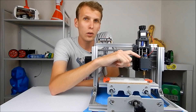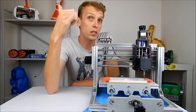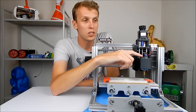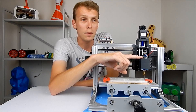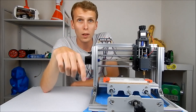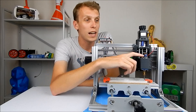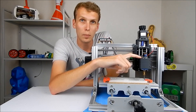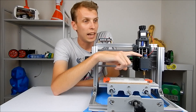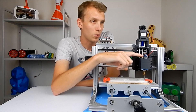This is a little bit harder to tell from images. The motor that's the size up looks very similar, however when you see the larger motor in a CNC image, it will usually have a big fan on top that blows air down over the motor to keep it cool. That can be an indication of the size of motor in the machine you're about to buy, so look for that and avoid small motors like this if you can.